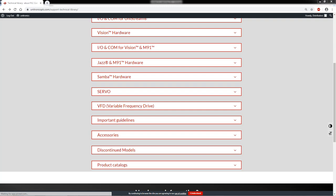So the web server that I mentioned has a tunnel in, it is connected to the PLC the same way that the panel is. So it's all one memory base. So if somebody on the web server were to change a set point, if you let them change the set point, if that's an available option, that would be changing on the PLC itself. So yes, you can control the PLC through the web server.